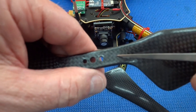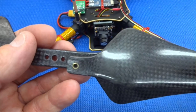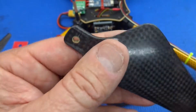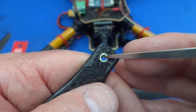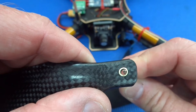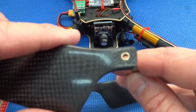The biggest failure risk is at the root. So we measure 12mm back and drill a hole there — you can see it's well back on the prop, which allowed me to grind off the end to equalize the weights. Then I drilled and chamfered the hole. If we simply stuck a screw in there while spinning, that screw would pull against the inner edge of the hole, focusing all its energy right there — and we don't know the quality of this carbon fiber.